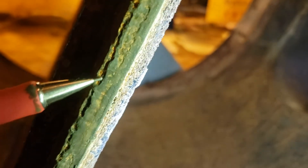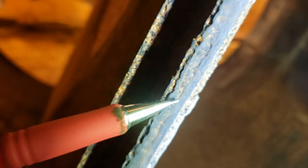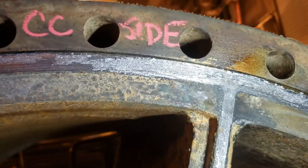This is the channel cover end. You can see that it's both erosion and corrosion — erosion because the edge broke down, and corrosion from where the corrosion mechanism actually pitted right there in the middle of the gasket. Probably where, once the flow was static, it was corroding. You can see that the gasket pattern is present where the gasket didn't corrode. Pretty spectacular.